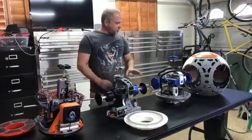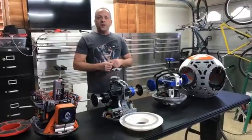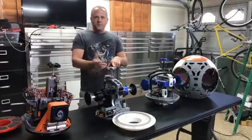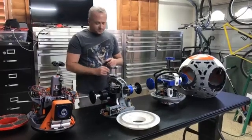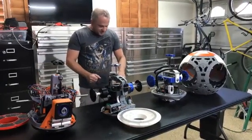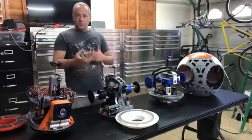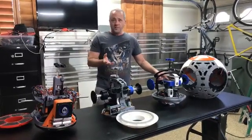See where you live about sourcing material — sometimes you can't get magnets overseas that we use here. What you'll find is a lot of the drives we're designing right now for the club try to use off-the-shelf stuff. A lot of mine has Servo City gears, little clamps, things like that, and a lot of it's been 3D printed. The magnets I'm using are half-inch by one-inch, and overseas the closest equivalent would be 20mm by 12mm or 25mm by 12mm. When you're researching the different drivetrains and we give out the BOM — the bill of materials — you may want to do some research and find that you can't get a certain motor in Sweden or wherever you happen to live.